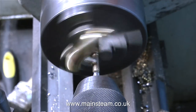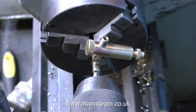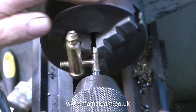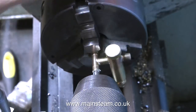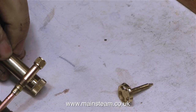I've now put the steam tap and displacement lubricator assembly back in the lathe and I'm drilling from the other end using a centre drill. The centre drill drills a hole in the end which is at 60 degrees, which will match a standard union cone. Here's a top tip: if you're using a centre drill to drill into an existing hole and it chatters, all you have to do is just turn the lathe by hand and it stops chattering, and you get a good finish.